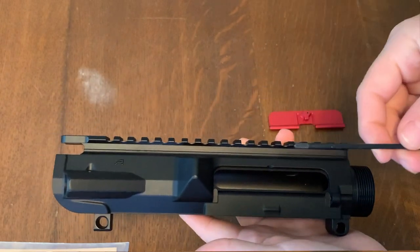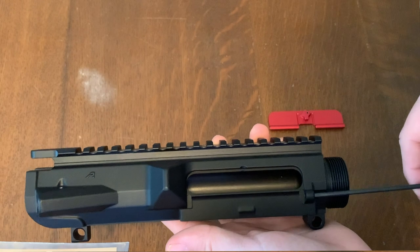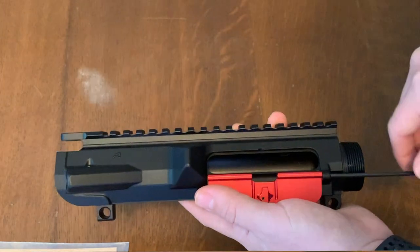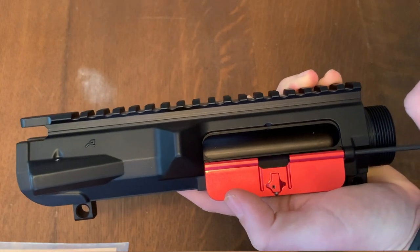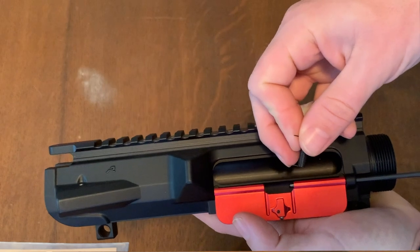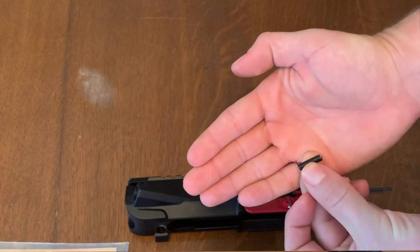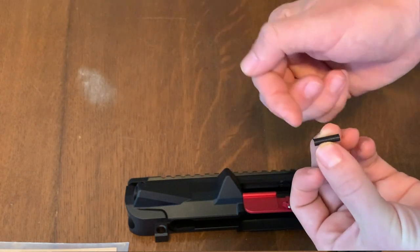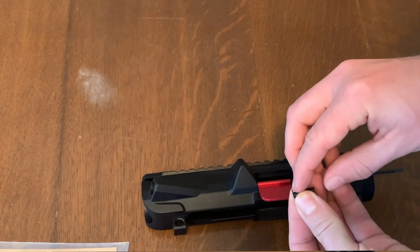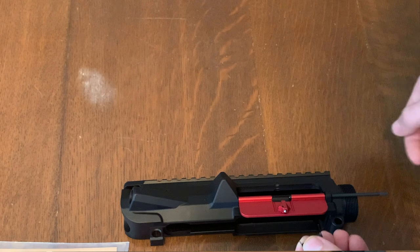To start, take your rod — there's a little textured end, and that's the end that goes away from you, while the other end goes inside. Start putting that in the hole, then take your dust cover and get it lined up. Push that rod through barely right here. Then take your spring — you can see there's a short end and a long end. The long end goes against the dust cover, and the short end goes against the receiver itself. To do this you need to put the spring under tension: the short piece goes against your receiver, then you twist the long piece around and put it against it so it's under tension. Then you'll slide the rod through.